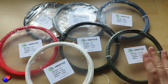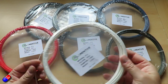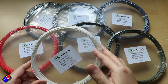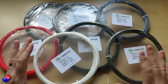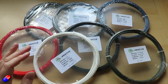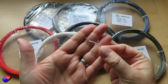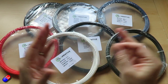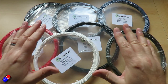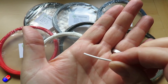In terms of the benefits, this stuff is super easy to print — it's the one I'd recommend if you've never printed with anything before. Most printers come supplied with a little bit of PLA in the box so you can get started and get everything dialled in. It's dimensionally stable, meaning that when it's in liquid form versus solid form — melted and being printed versus when it's set up — it doesn't change volume. That means parts can be printed really nicely, and it is a beautiful shiny plastic, particularly in black.